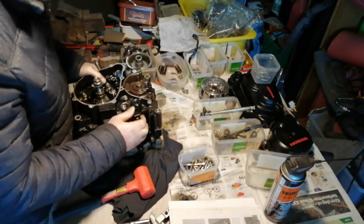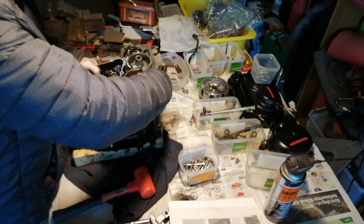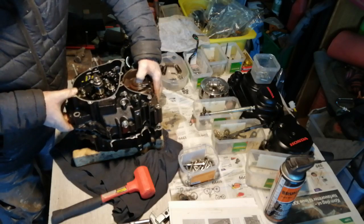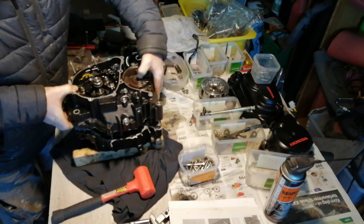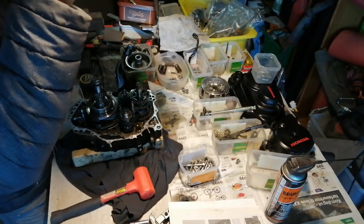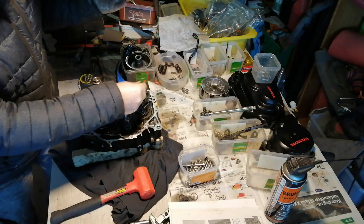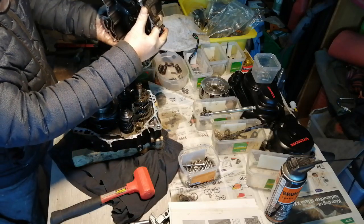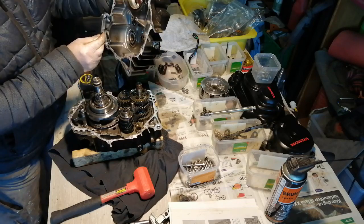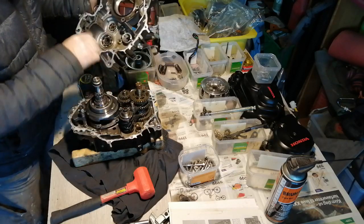I'm just tapping upwards on the actual casing and it's enough to start it going. I'm lifting it off. Of course there's all sorts of stuff inside this, and what worries me is that I'll pull something out and not be able to see where it came from. Don't tip it until you've had a look. Just go up like that - you see, that was a thrust washer, and I saw where it came from. So you need to be very very careful that you don't lose anything. And there's another one - check them all for these thrust washers.